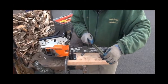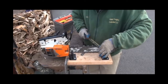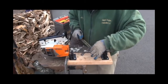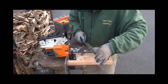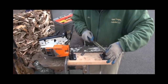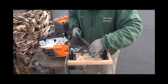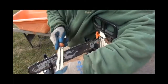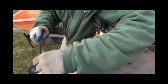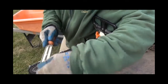Hi folks. Today I wanted to show you a job I did where I took out an oak tree. That's just me doing a maintenance sharpening on my Stihl 020, getting ready for the job. That Stihl chainsaw I purchased in 1992, so it's over 21 years old. It's made out of mostly metal and has quite a bit of power for a saw that size. I'm using my Chainmeister bar clamps to sharpen the saw, which just make it such a pleasure to do sharpening in the field.